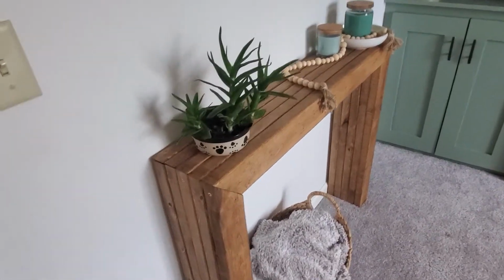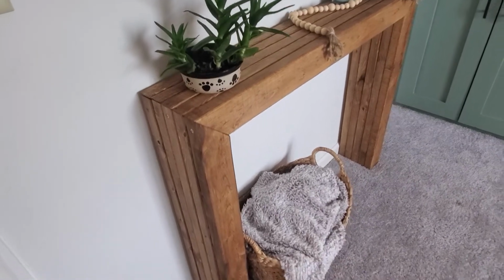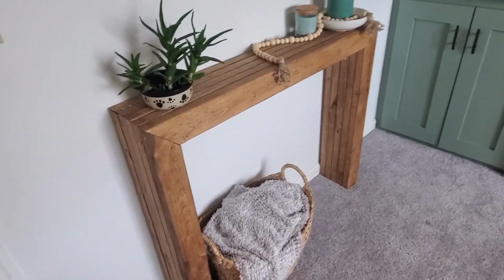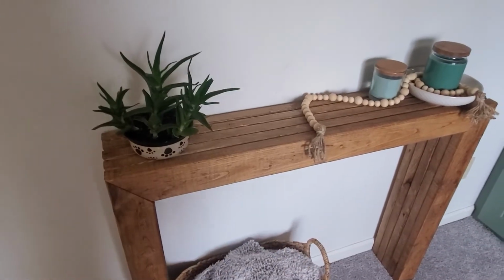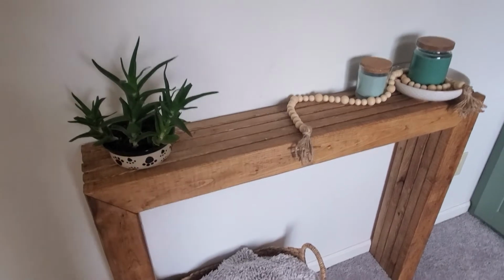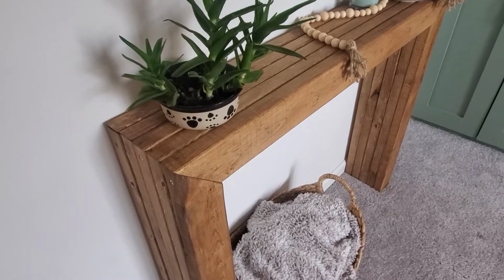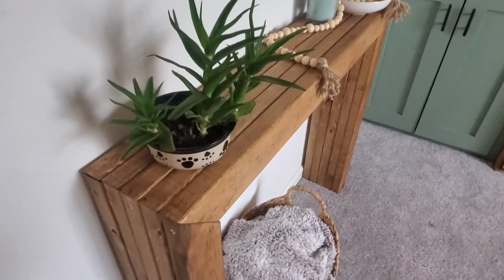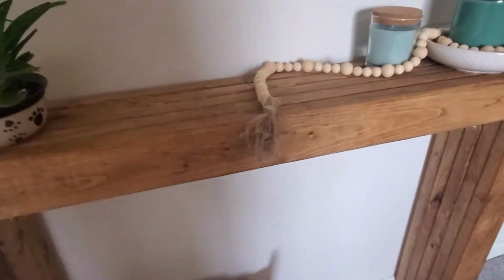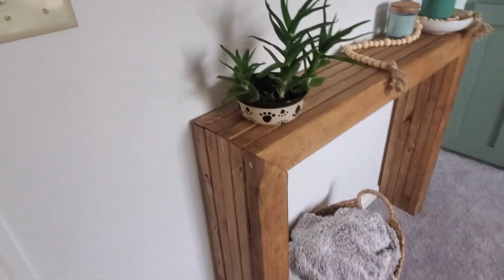So we just ended up taking, I think, 1, 2, 3, 4, 5 2x4s. I think they were like 8.5 feet long. So I think the table is something like 36 inches long and 34 inches high, something like that. So just cut 45 degree angles with a miter saw, and then just put the bottom layer down and started doing screws from this way so you can't see anything along the front. But they're just all screwed together.